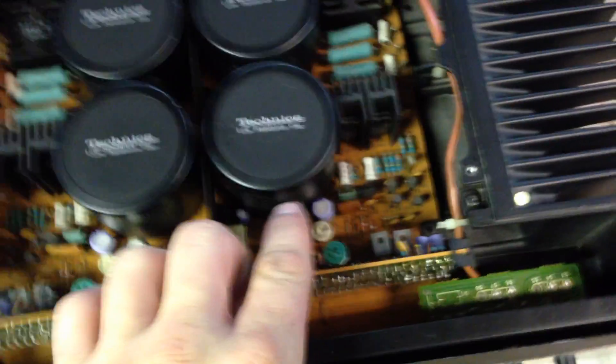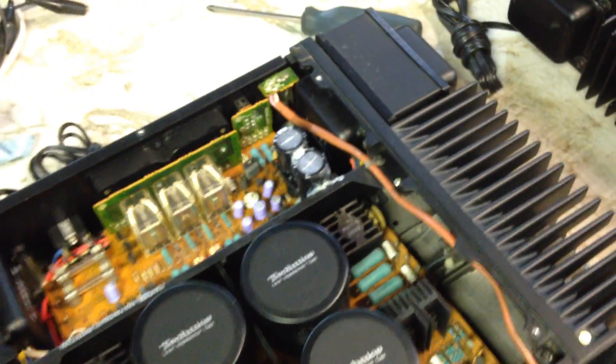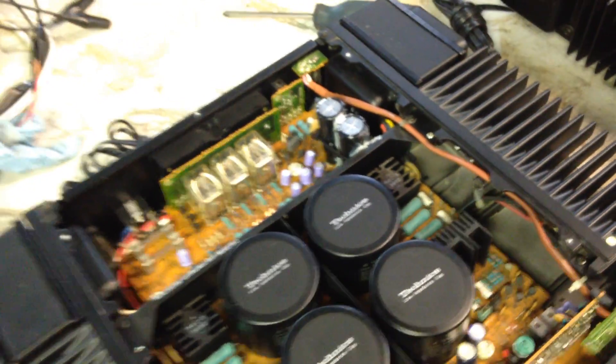But there are actually a couple smaller ones in here that I don't think are very good. I've already had to replace two capacitors for the regulator voltage supply because they had completely failed and caused nasty hum. I had to do that in both amps — they both failed the same way.